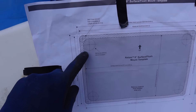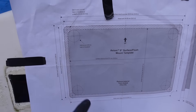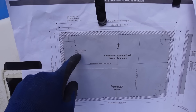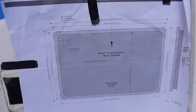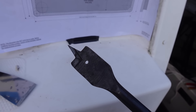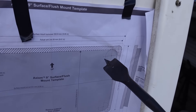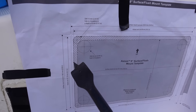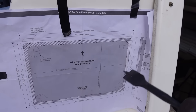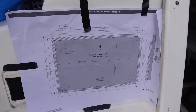I've positioned the template and it's very close on this edge where that circle is — just hits the dotted line, so I have maximum width. I just need to drill these corner holes, which are 24mm. I'm using a spade bit that does 24mm, with a nice pointy tip for the initial start. What I'm going to do is mark all four holes first with a small spin at each corner so that if I drill through the template paper I've still got the other holes marked.